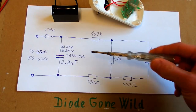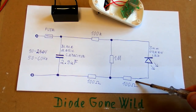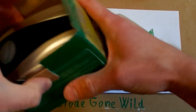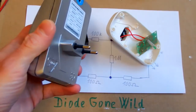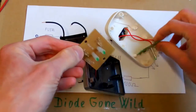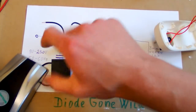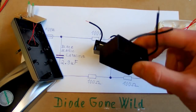But the discharging resistor doesn't work very fast, so if you unplug it quickly and touch it, it can give you a shock. There are also two resistors with a very low value — just 100 ohms — and I'm not sure why they use them, as they have almost no effect and are more or less just jumpers. It looks almost the same as the other version that comes in a box. That one had only 1.45 microfarads; this one is 2.9 microfarads — twice the value.